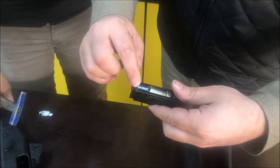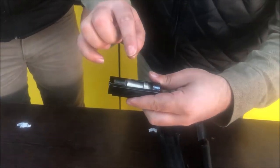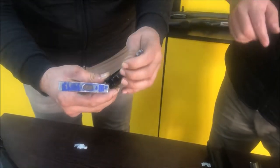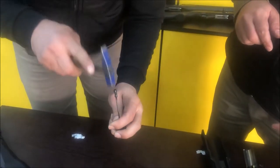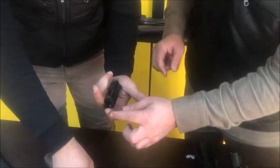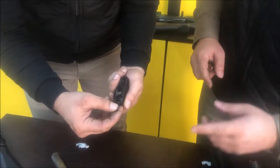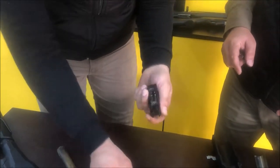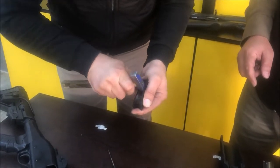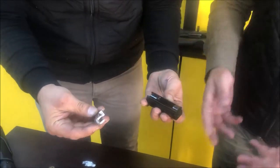The pin works from here to here, locking the firing pin and firing pin spring inside, and also keeps the lock in its place. From top to bottom, simply push that pin out. Be sure to keep your finger here because the spring may push the firing pin out. Take this out and remove the lock.